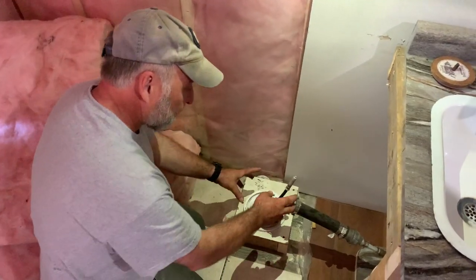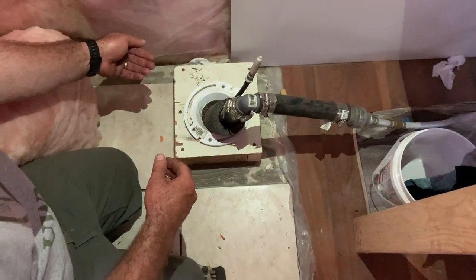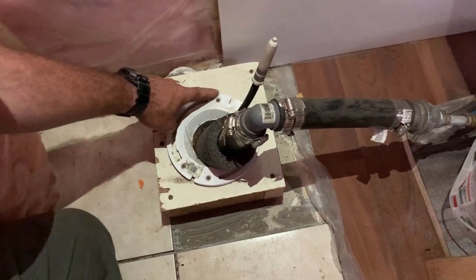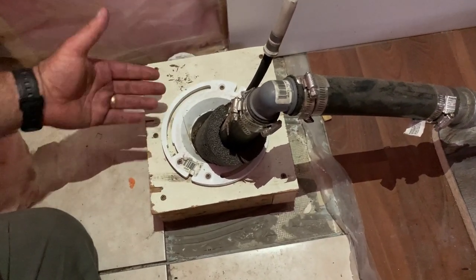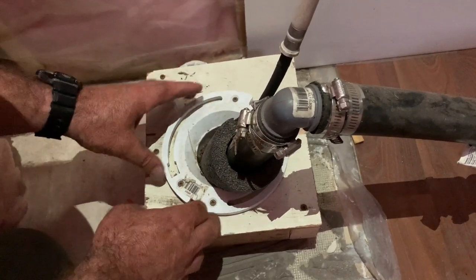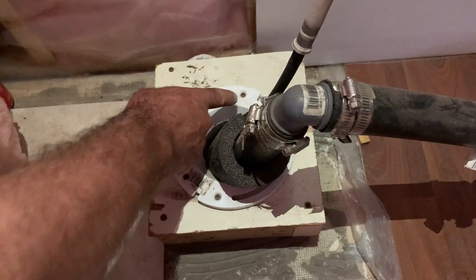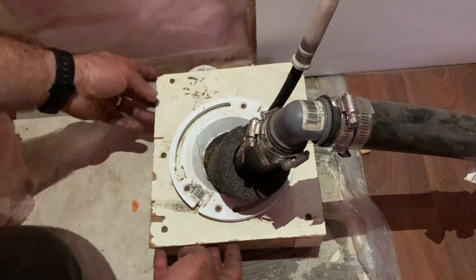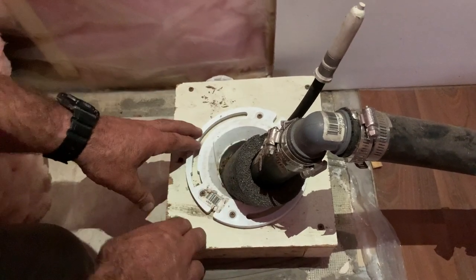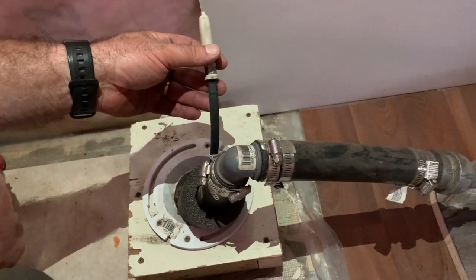Some time has passed and the water line is actually installed. I just want to show you one little trick — it's very useful for bringing a water line up into a building that's raised off the ground. This is a toilet flange. Normally it would be connected to drain pipes and a toilet would bolt to it, but it makes a perfect setup for neatly having that pipe come in. It fastens in this case to this little raised box, or it can also fasten directly to the floor, and it just gives you a nice, neat place for the pipe to come up. And here you can see that smart heating cable.